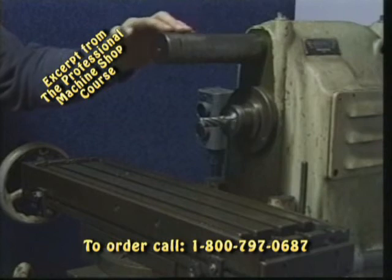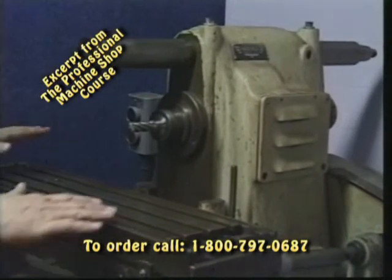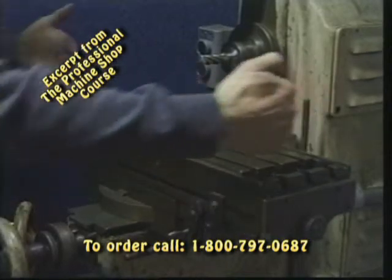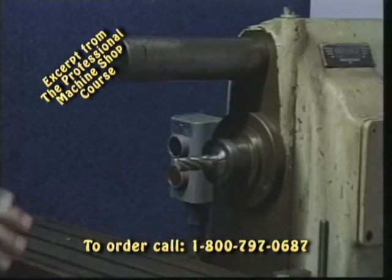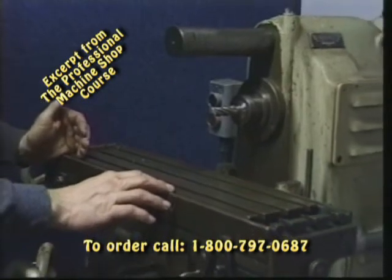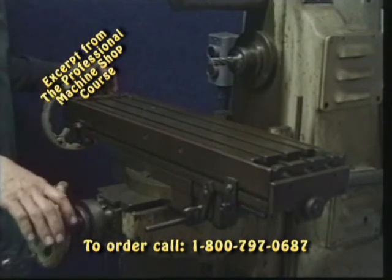When you set your machine up this way it's a good idea to reverse the overarm support. We've got a tapered threaded nose on the other end — we don't want to bung up the threads and we don't want the overarm sticking out interfering with any workpiece on the bed. We can bolt something directly to the bed using clamping techniques, mount a vise, or a tooling fixture for that second operation. We can also adjust the bed to mill an angled slot — there's a degree setting on the bottom of the mill bed. We can mount a dial indicator on the overarm to dial indicate a part and fine tune our bed. These are light duty horizontal machines, great for second operations in the machine shop.